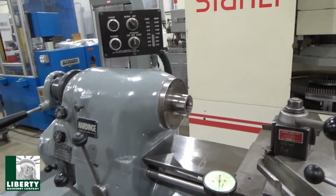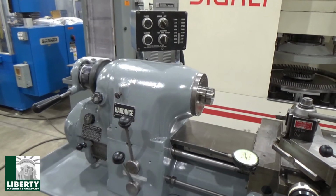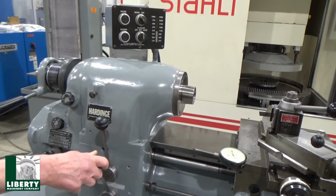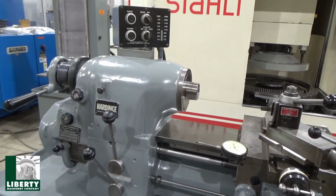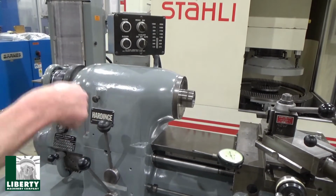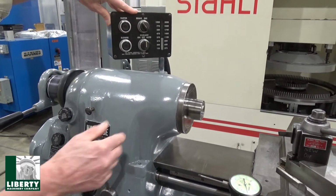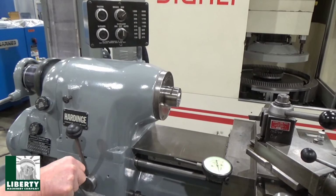As long as we're doing spindle, let's cover forward reverse right away. I'll stop the spindle. If you notice it's coming forward, stop, go to reverse, go back on again, low speed, and we're in reverse for what it's worth. Stop, dump that contactor, back into forward. We do have the threading box on right now. For the sake of listening to the spindle, I'll shut that off and bring the spindle up in a minute. That was the faster, slower up here. Brake, let's go faster. Brake on, see 1, 2, 2.5 seconds, brake off, makes a little bit of a difference.